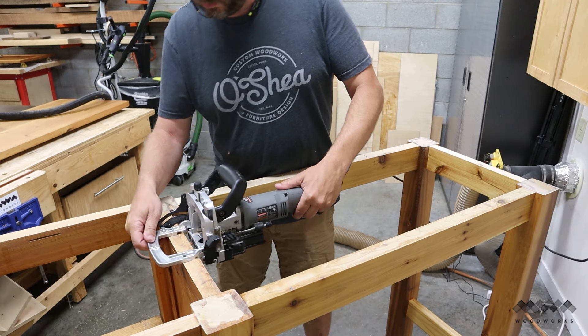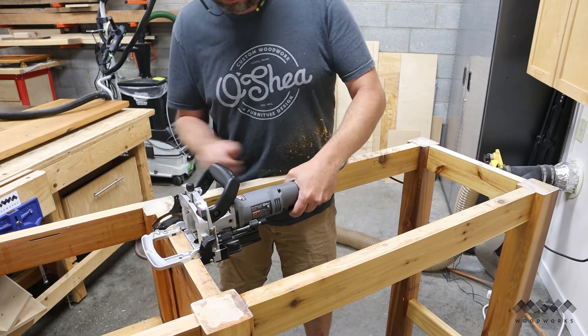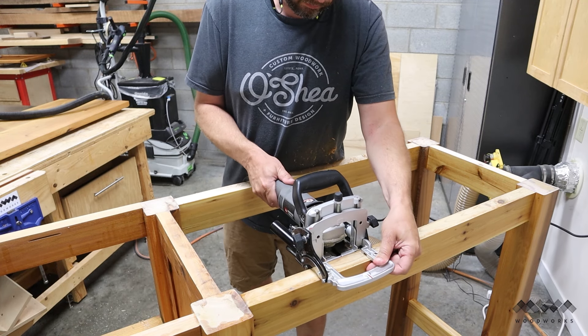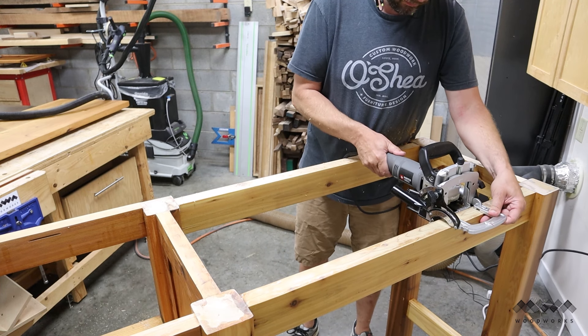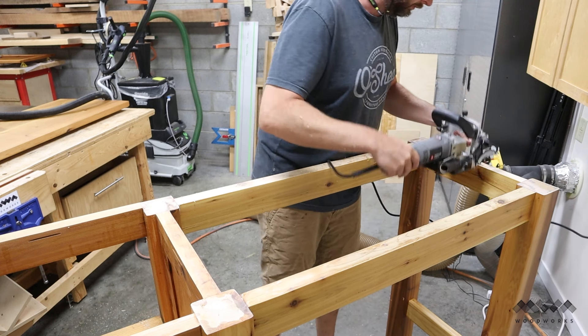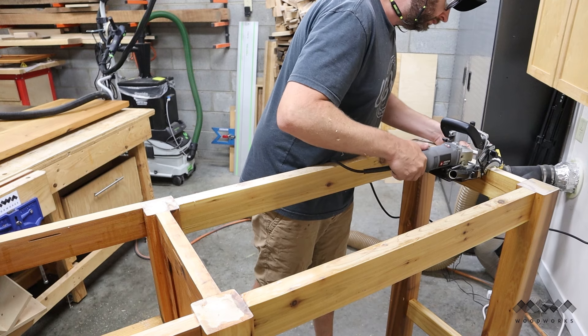As far as I know, there's no hard and fast rule for how many z-clips to use on your tabletop. It probably depends mostly on the size and how heavy the table is, and also how you anticipate things like the tabletop cupping or warping over time. I went with twelve on this table. It's not real wide, and the cedar is a relatively light wood species, so there won't be much strain on the top when I pick it up or move it around.